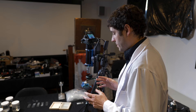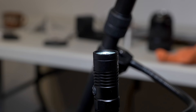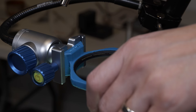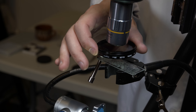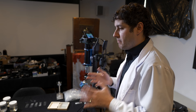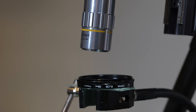So here we have a makeshift polarizing microscope. It's using some fairly complex things but when you break it down into the individual components it's really easy to put something like this together. First we have a light source which is just a simple LED flashlight. Up from that we have a polarizing filter — the light has to be cross polarized. So you have one polarizer in front of the light source and then another polarizer on the other side of the subject in opposition. Normally when you put polarizers in opposition to each other you would end up with a black image, unless there's something in between that interferes with the polarization of light — then you will see some colors coming through.